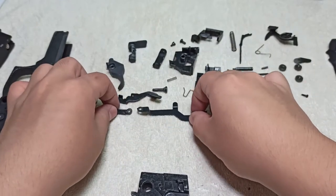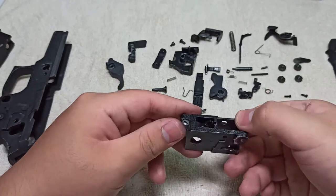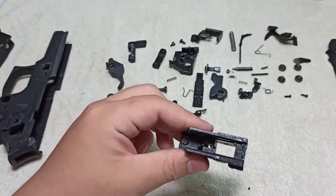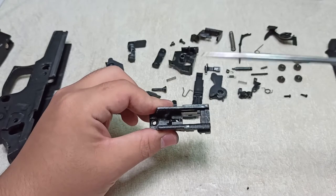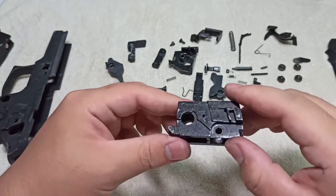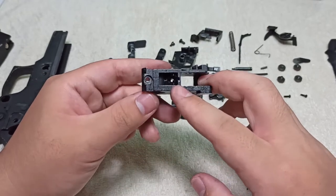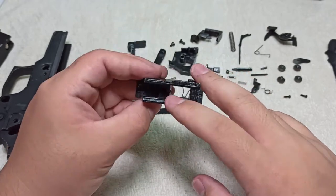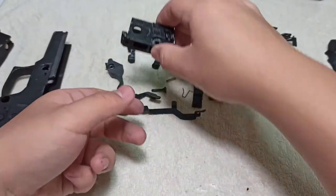What I said earlier is that this piece goes in this placement — it locks on like that and becomes one and the same with the trigger bar. It does not go on the other way — that is wrong. That is one of the main mistakes people make. That's the entire disassembly of the sear block. The sear release lever spring I will not demonstrate, as you won't need to do that unless for repairs — just push the pin out and the plastic piece, spring, and slide lock peg will come out. Congratulations — you've completed the entire disassembly of your P226.